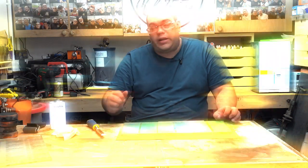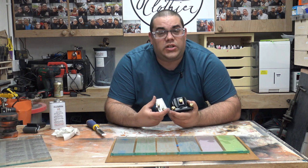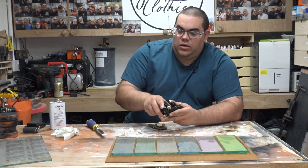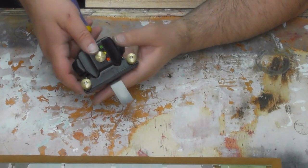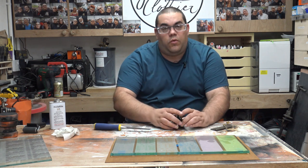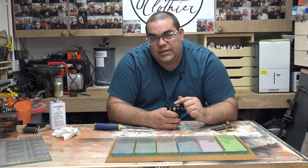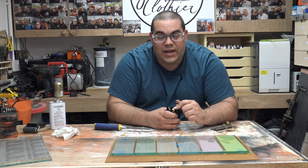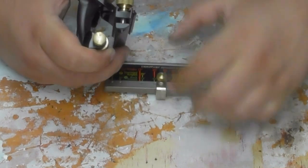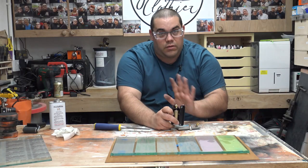Now I'm going to talk about the jig because it was a bit complicated when I first took it out of the box. The way it works is you clamp your chisel into here, and because of the roller it keeps it at a set angle while you draw it across. To set it up: first make sure at the bottom this little arrow is pointing up — that's the default position. This adjustment is used for adjusting the angle away from the calibrated mark. These are all the calibrated marks. I've got mine set at 25 degrees — with the arrow up it's at 25 degrees. If you move it down that offsets the angle from 25, but I want 25 for now.